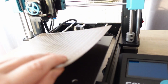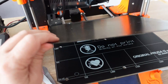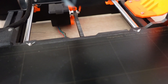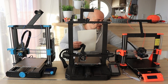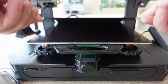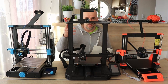The build plate: the Sovol and Ender 3 S1 Pro arrived with textured PEI sheets, which I really like. The Prusa arrived with a smooth PEI sheet which I use mostly for PLA; for PETG I have a separate textured PEI sheet, and it is two-sided. A key difference with the Prusa is the accurate sheet positioning thanks to two pins — I can place the sheet in just a second in exactly the right place and use the grid lines in the slicer. On the other printers I have to watch the edge of the heated plate and approximately position the build surface.